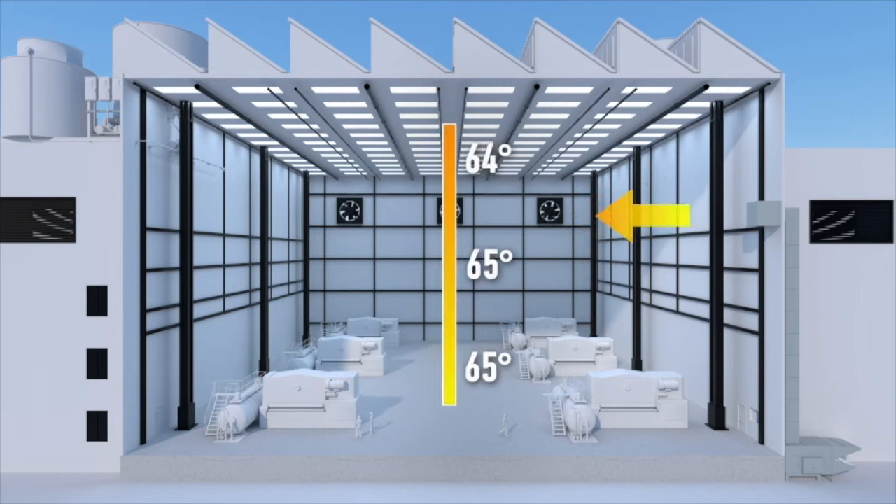The units are also designed with two particular features that allow for year-round usage and comfort: a fully modulating temperature control system with a 20-to-1 turndown ratio, and the ability to add on DX, chilled water, and evaporative cooling technologies. CFM ranges of 1,800 to 75,000 are available, along with the ability to customize the system when mounting to your facility.